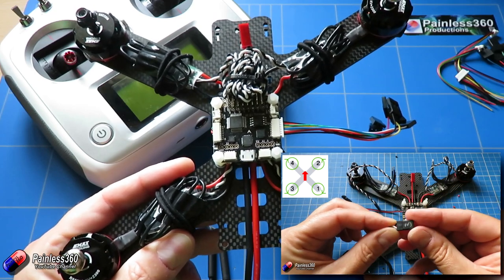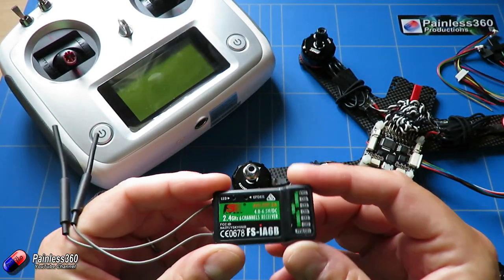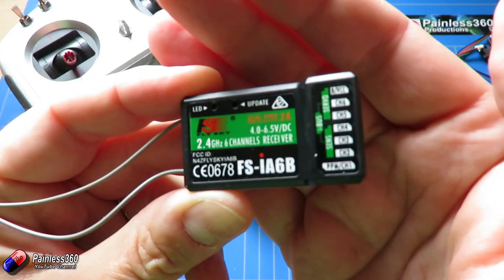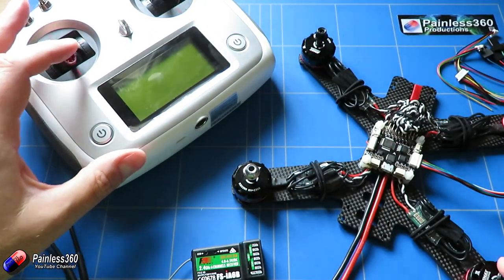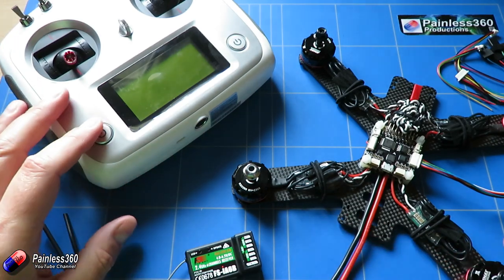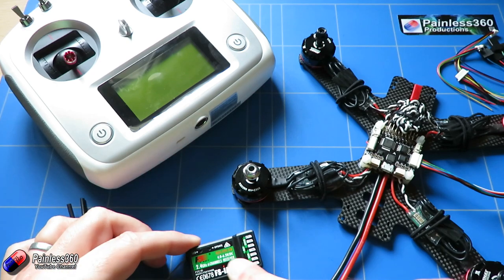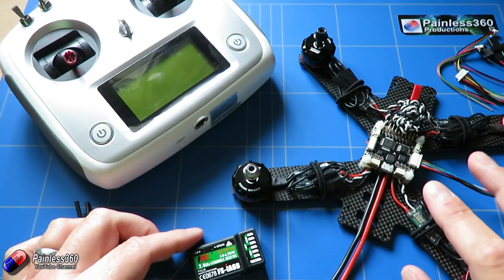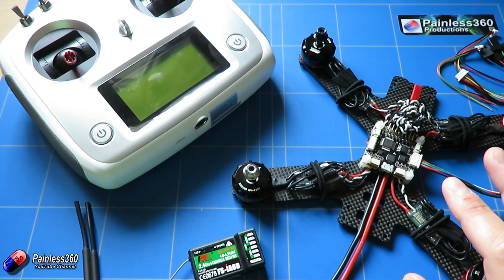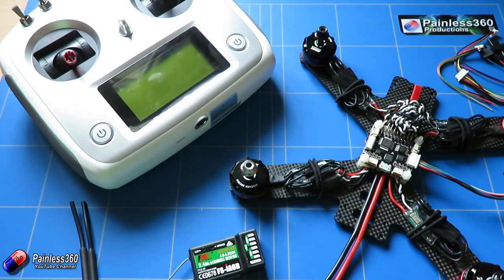Now we are ready to attach and configure the radio. The radio system also works on 5 volts. We're going to add the radio receiver onto the craft and plug its connections into the flight controller so it can hear what we want it to do. We also need to set the radio up. I'd always recommend setting the model up in the radio before binding the receiver, then plugging the receiver into the model and checking everything works. By the end of this video we'll have the radio set up and installed, and in the next video we can connect to CleanFlight and do the final setup and configuration, then we'll be ready for our first test hover.